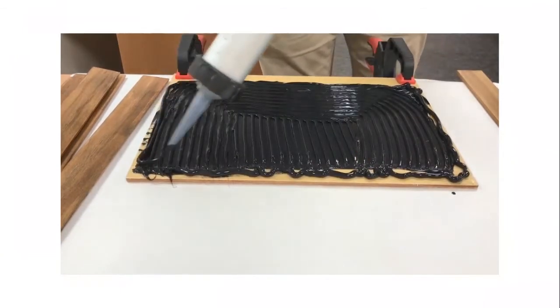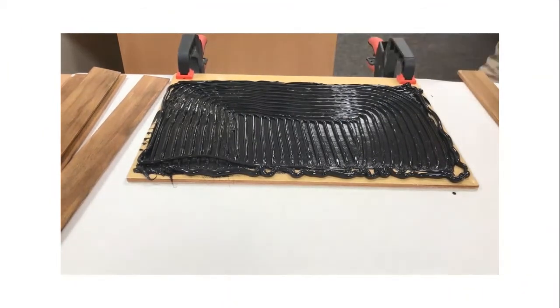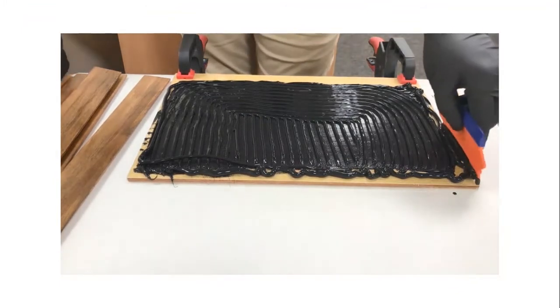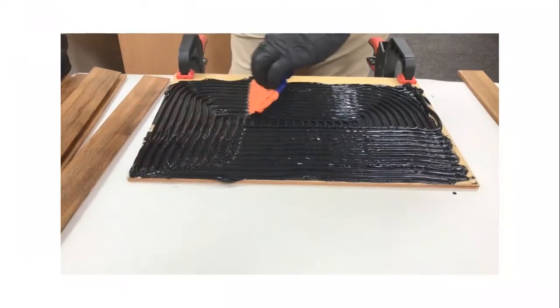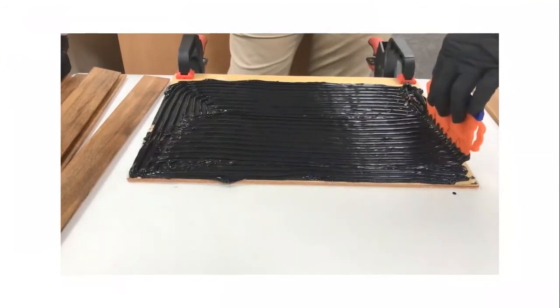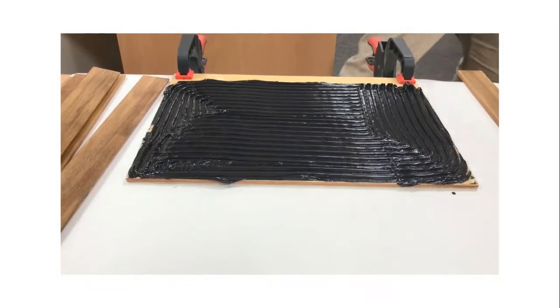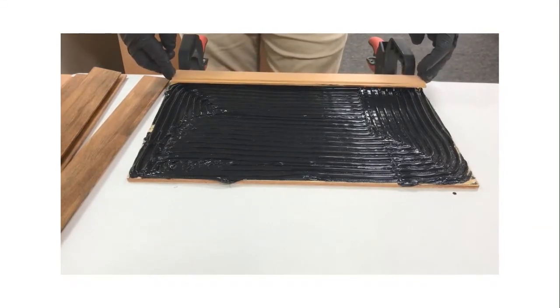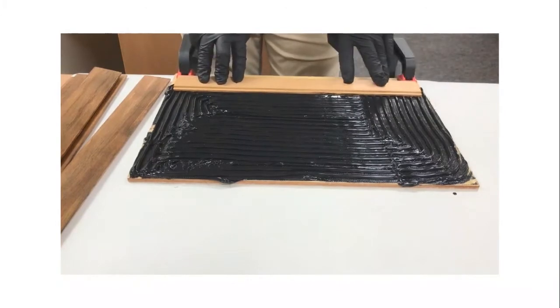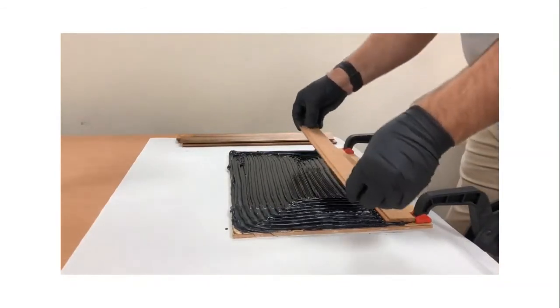Okay, and just for Marineware, we do a whole load of epoxy adhesives. Why would you choose a flexible adhesive like this rather than an epoxy? I'd say the main advantage overall with flexible adhesives, and something I forgot to cover when we were talking about window bonding actually, is you tend to find with different materials, laying a teak deck onto a GRP boat or a metal boat, and the same with windows, that things expand and contract at different rates, and a flexible adhesive will deal with that quite well. But if you've got a very strong but brittle adhesive, and things move at different rates, you might find things break away. So distinct advantage, a big tick in the flexible adhesives box there.